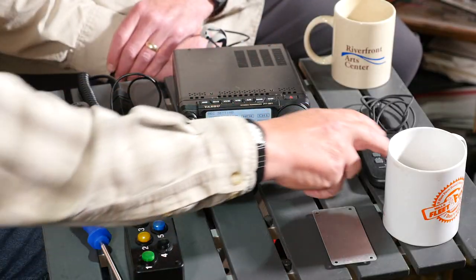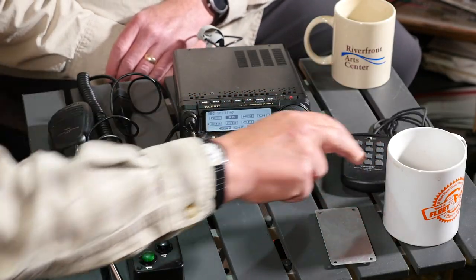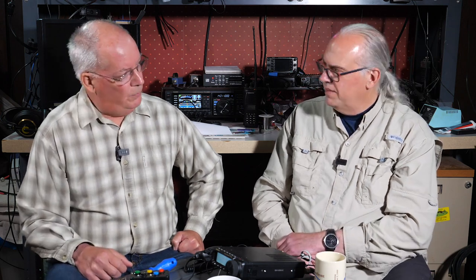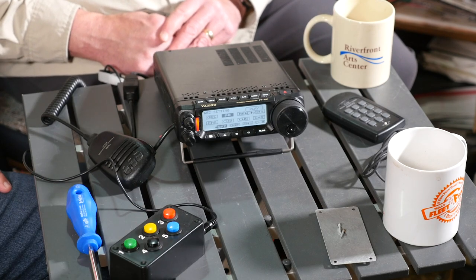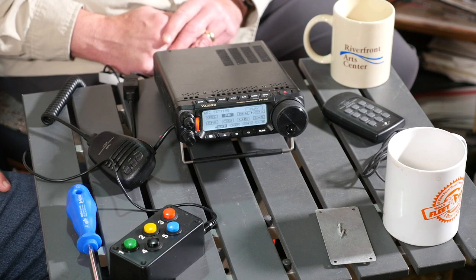It's doable, but it's a pain. In an activation, you've got a log, you've got your pencil, everything that's going on — it's just not very handy. That's why Yaesu developed the FH2 product. Now we've got the DIY remote plugged in. If I push the number one button, it should automatically trigger and play that CQ message — CQ, CQ, Parks on the Air. CQ, Parks on the Air. KB9VBR, Kilo Bravo Niner Victor Bravo Romeo, calling CQ for Parks on the Air. You could have this in your lap, in your hand, or sitting on the table, and you don't have to reach over to the radio every time.